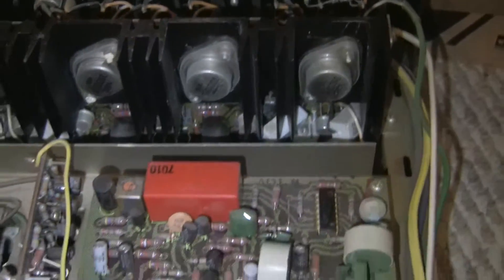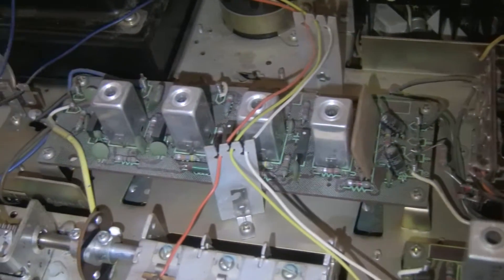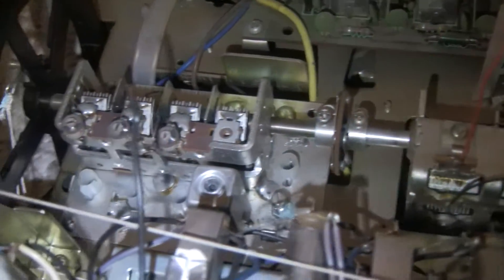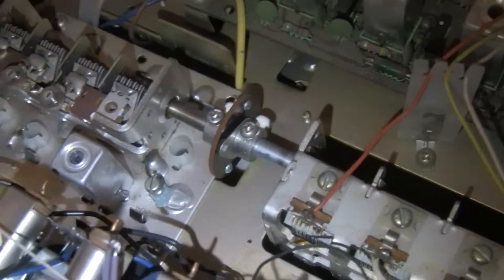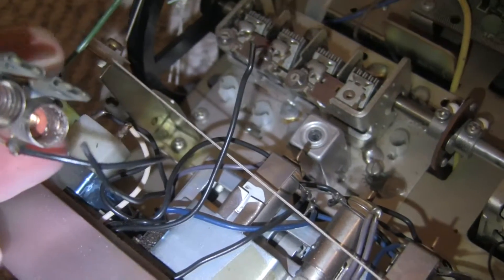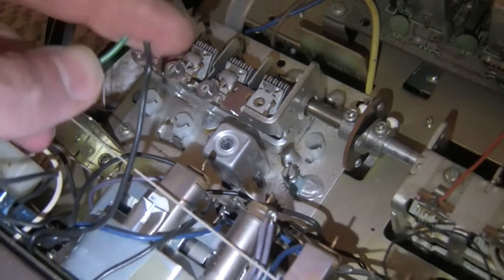If you keep blowing fuses, you need to take it to somebody qualified to fix it, not try to do this yourself if you don't really understand what's happening. There are nice ganged tuning capacitors for FM and AM, and nice easy-to-replace bulbs. This one had another interesting issue: I was able to take the meter apart and actually fix it. The AM wasn't working because the meter itself was electrically open, and yes, I was able to creatively fix it.